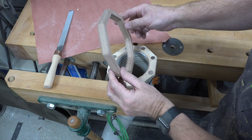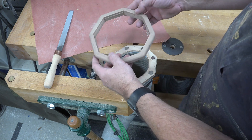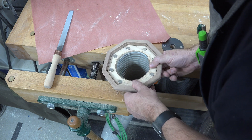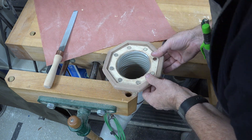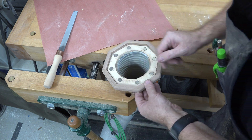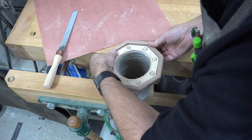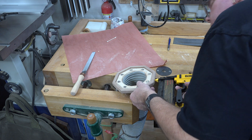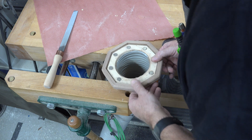Okay and I've got this sanded up the way that I want it. I actually routed both sides just to give it a nice profile. That's actually a nice octagon frame — I kind of like that. Maybe we'll have to do an octagon frame tutorial on the show. Anyway, truth be told this is a pretty tight fit so I had to go around and file some of the edges of the original dust collection to get this to fit properly in place. So I'm going to get this lined up so that the top of that rabbet is flush with our dust collection fitting and then we're going to get the pin nailer and pin this in place. I was going to glue it but it's such a snug fit I really don't think there's much point.